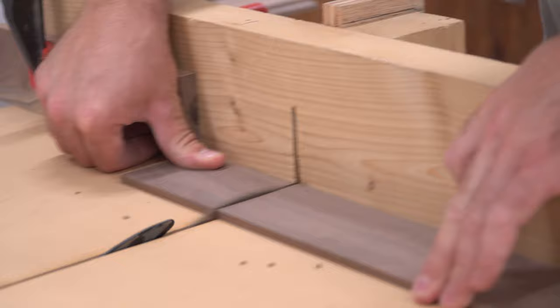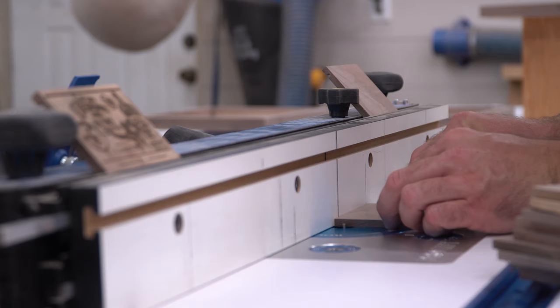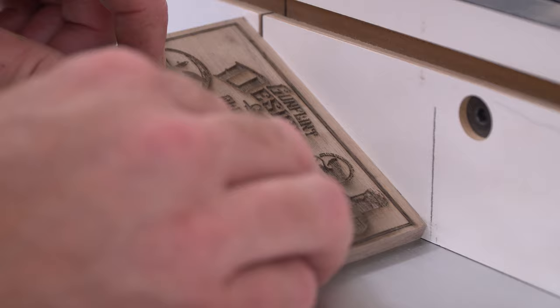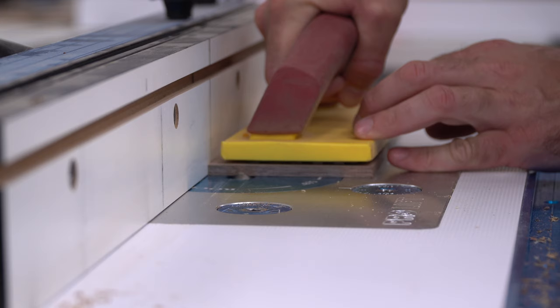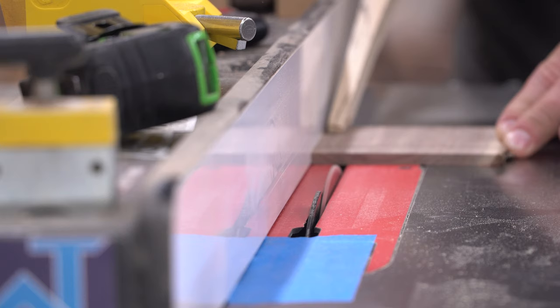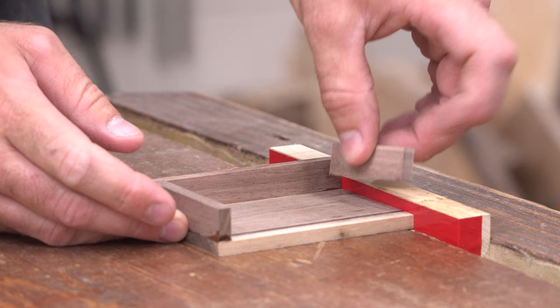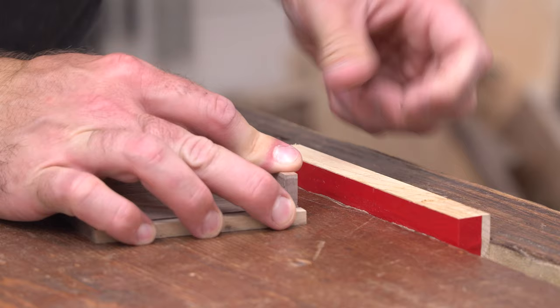Moving forward, I tried to set up as many fixtures and jigs as I could to make batching out parts easier. A stop block on the crosscut sled made short work of all the side panels. Different start and stop lines on my router table fence let me cut all the dados quickly, and it looks nicer than passing all the way through. I also simplified the pull tab by eliminating the little glued-on tooth — instead I just routed a shallow groove in a board, then ripped thin strips from it. Once again I used CA glue and accelerator to assemble the boxes, putting a small block in my end vise and butting the parts up against that as I set them into place.